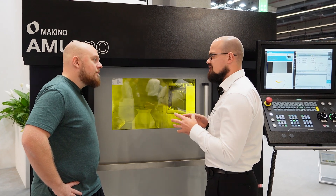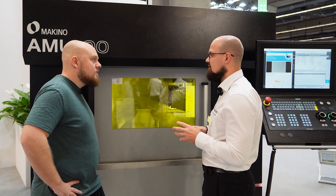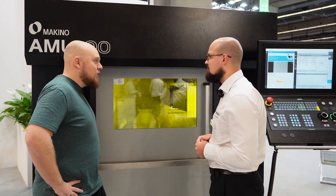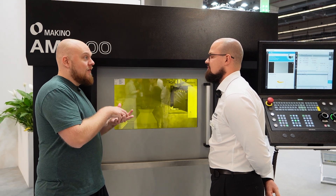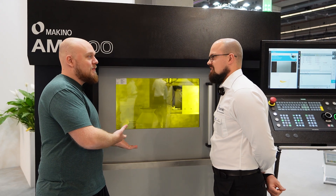What also becomes possible are copper alloys, but printing pure copper — that's challenging on our machines. So it's probably going to be a copper blend instead of pure copper. So you're just purging all the air out of the system, replacing it with a gas that is not going to react with the just-welded surface. Yes, so you get a more pure outcome out of this machine.